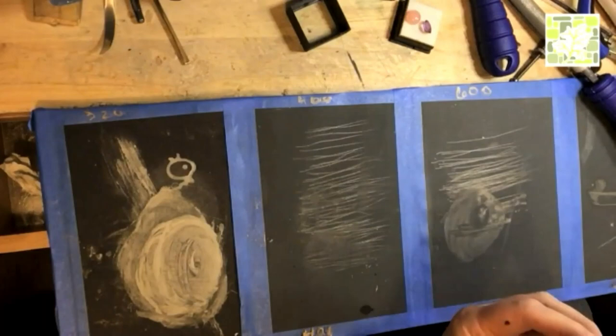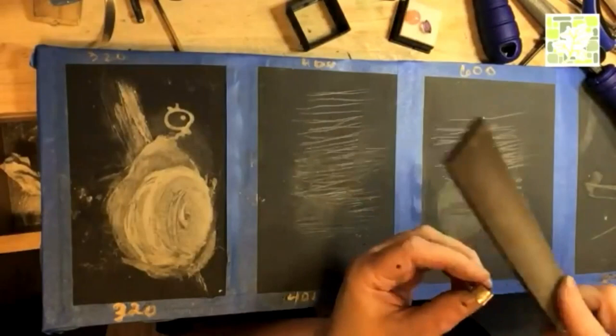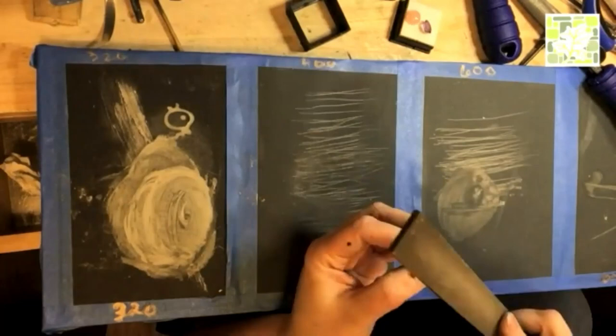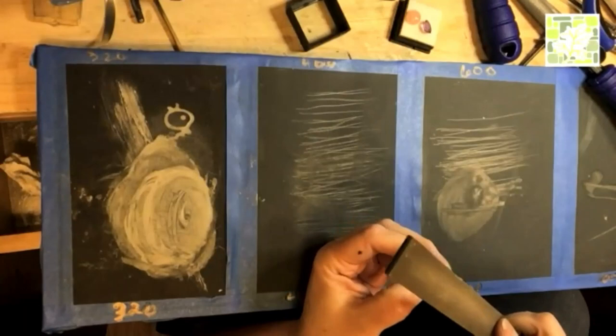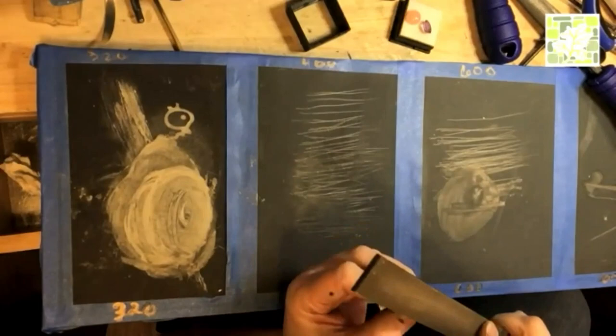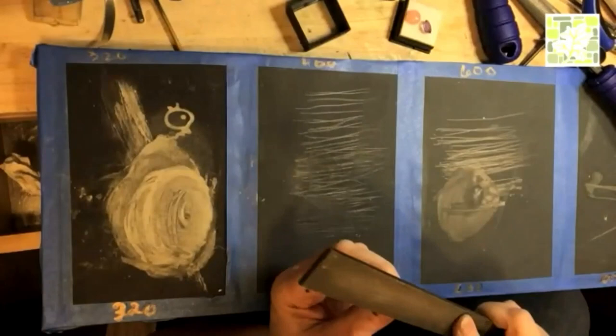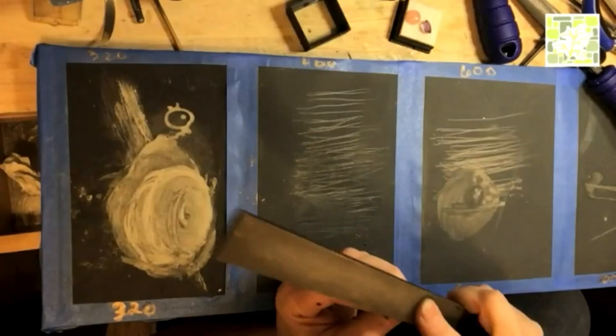I'll tell you what I've come to start using. Someone told me, you know, I've always bought wire solder, you guys. Well, take it through your rolling mill, smash it really flat, then cut little tiny snippets. Now, for the solder wanting to move around like you're having that problem with, I use paste flux, the white paste, called Handy Flux. I put a little bit on there, then I put the solder on there, then it just takes a few minutes to dry. And then when you take your torch to it, it doesn't blow it all over the place. It's kind of stuck in there like a glue. And that will help.